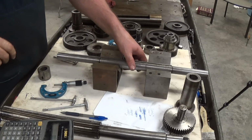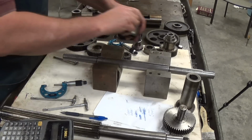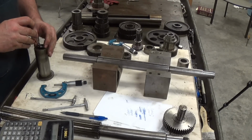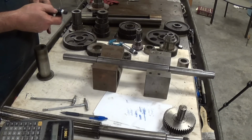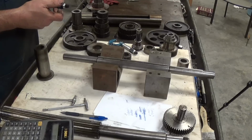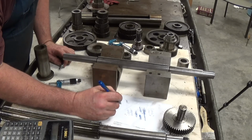Thank you for sticking with me with that. So we're going to rotate the shaft around and select another area. All right, so pop these back open. On this shaft here, this bearing we're reading 1 inch, 1 thousandth, and 9/10. So here we got 1.0019.